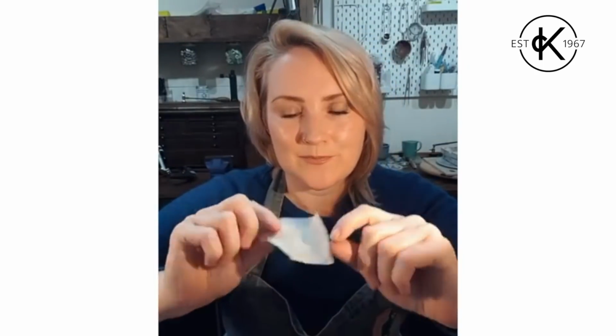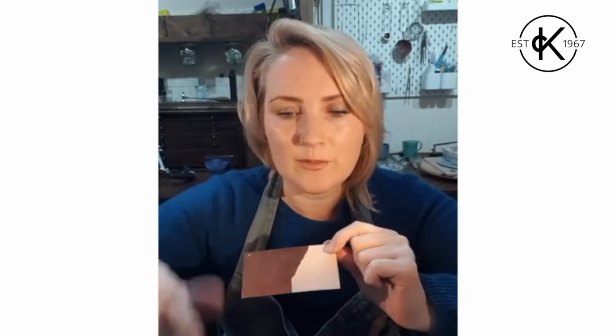The way I like to mark my metal is to take some masking tape and literally just plop it, technical term, straight onto your metal. Fold those spare bits away, or you could rip them off. And now I have a nice surface that I can draw onto my metal with any sort of pencil or pen that I choose to do that with.